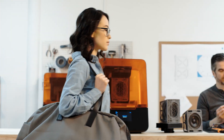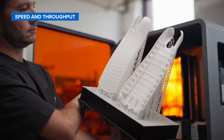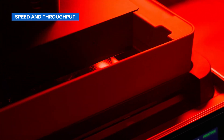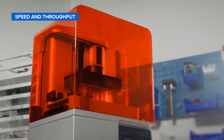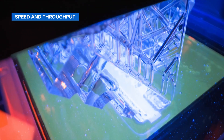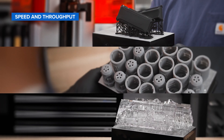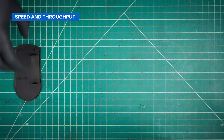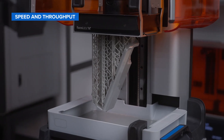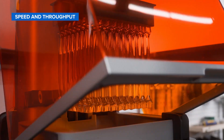Though all 3D printing processes are getting faster, SLA 3D printing has established itself as the clear front runner for the fastest 3D printing process available. The latest generation of MSLA 3D printers, like Formlabs' Form IV, rely on a combination of a powerful print engine and advanced optics systems to cure each layer almost instantly. Form IV can build parts as fast as 100 mm per hour using specifically designed materials like fast model resin, but most builds finish in under 2 hours using any material. Tall parts, the full height of the printer, can print in 5 hours using most materials, still allowing for multiple builds per day.